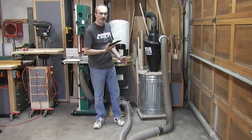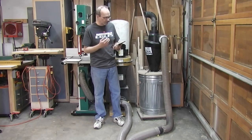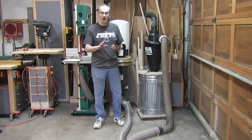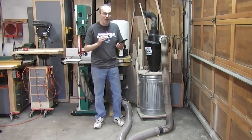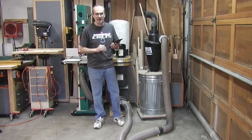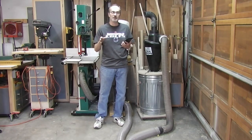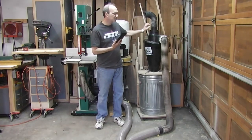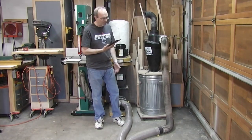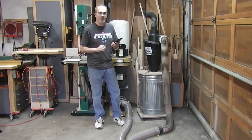Most people when they have a dust deputy have either a hose that's bent or a fitting on top like I do. So you can expect between a 30 and 40% drop from the dust deputy. I'm not bashing the dust deputy — I absolutely love it, it's one of the greatest things I've added to my shop. However, there is a significant drop in cubic feet per minute. I'm going to put 15 pounds of dust and chips through this, get it dirty — I'm still going to use a dust deputy no matter what — and then take some measurements after it's been dirtied up to see if there's a difference in airflow.